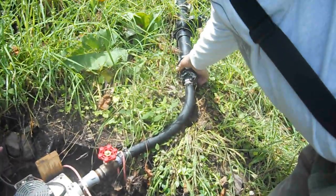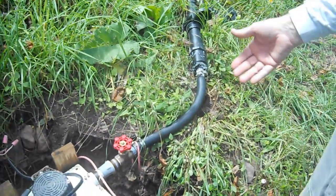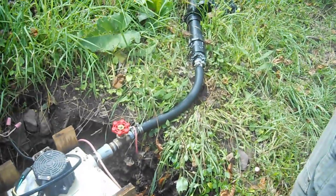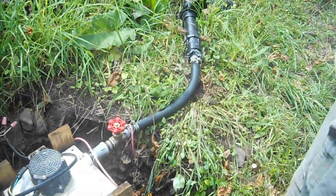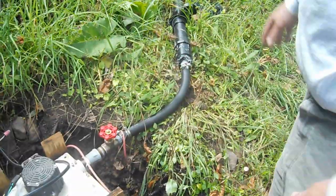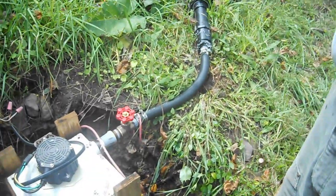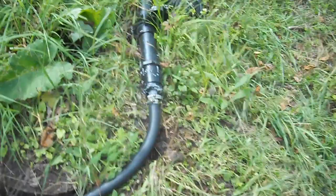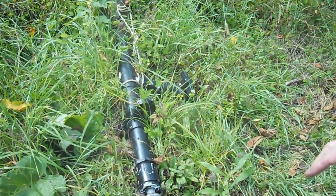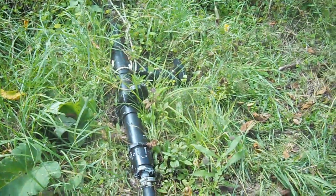This fitting here is really just hand tight — I can just unscrew this fitting — so that comes out and I just flush the mud in the line after every vigorous rainstorm, which is no big deal. It's just something you have to be attentive to. I have differing valves — there's a ball valve and a gate valve — no real reason for choosing one over the other, it's just what I had. So I can really control where the water's going pretty much all the time. That second valve off to the side — that's just a bypass valve — so when I'm doing some work and cleaning out down here, if I want to continue to flush the whole line, I just open that up and it runs off into the creek.